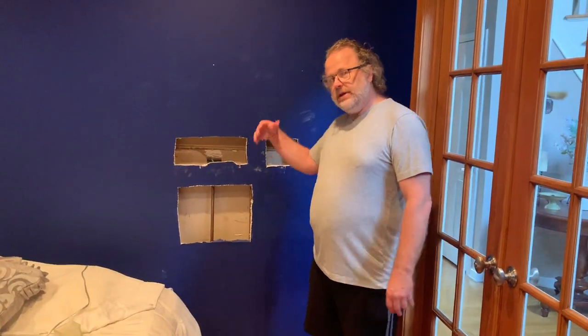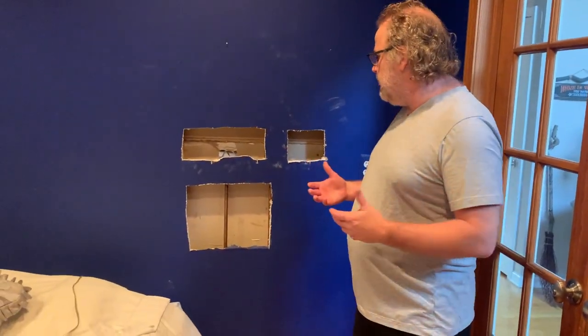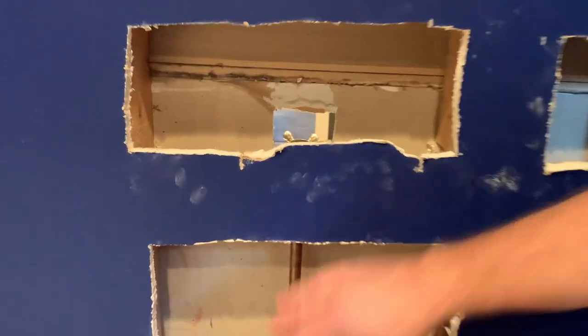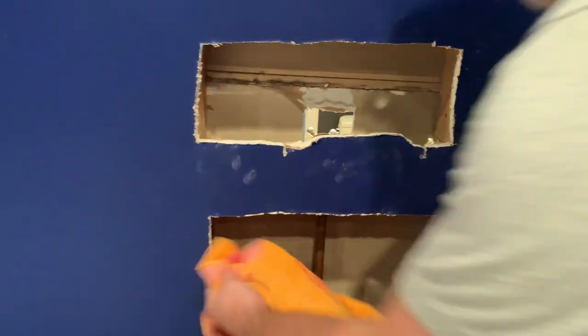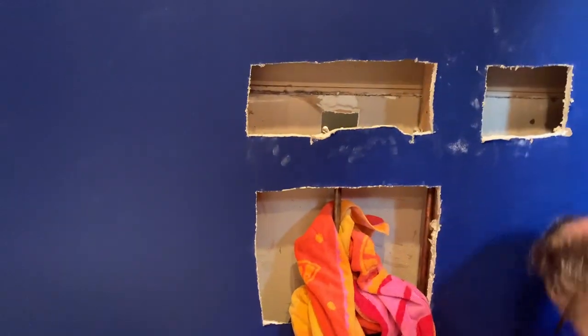You can see I've got a bunch of cutouts here. I didn't know what I was working with, so I took more than I needed just to see what was going on. I cut out here above the handles and the faucet valves, and here down below. Here's the cold water; the hot water is to the right where the 2x4 is. There's also a wind support beam right here, which is why that drywall was not cut out. I also noticed when you take out the valves, water leaks through and gets down into the bottom, so I put in a couple of towels to soak up the water so nothing gets into the drywall or causes mold.